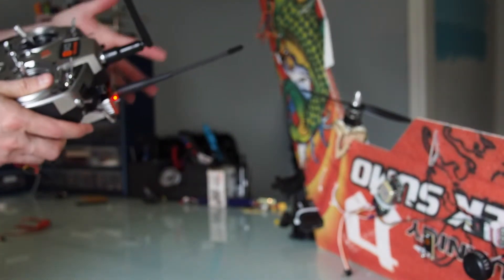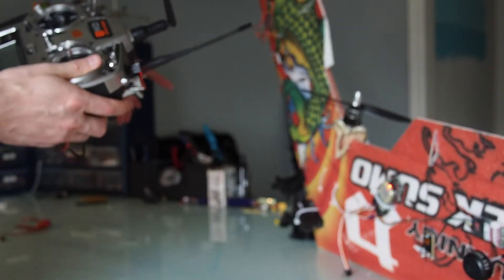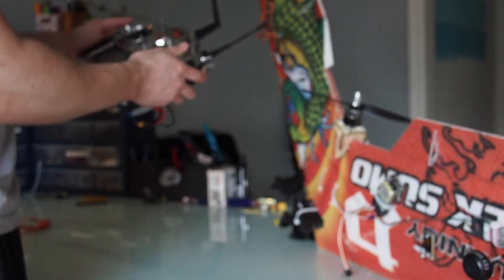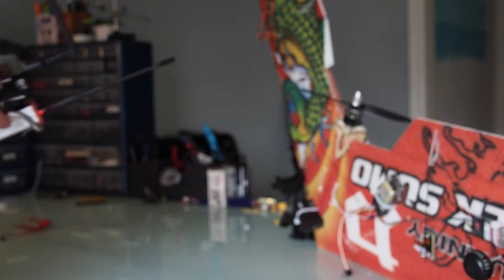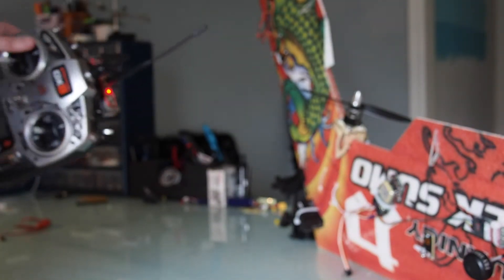I think what's going on is the EZUHF system is sensitive to other wires or electrical components — you can hear the chatter as I get close to servo wires, which who knows what that does to the other electrical components. The moral of the story is separation is better. Use Velcro, try to keep things separated. Maybe I can even build a shield.